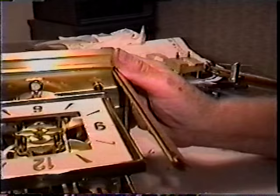I like to cover a little bit of this winding mechanism on this clock. You say, how does this clock wind? Nobody ever winds it. It stays on the shelf and it runs for time and time and nobody winds it up. Well, what's in this aneroid tank is a bellows. It looks something like this here. I have a reserve one. It's a bellows type can, and as this bellows contracts and expands, it winds this spring up. And what it does is wind that mainspring up like that.